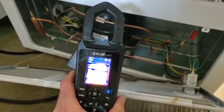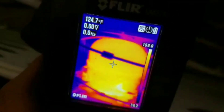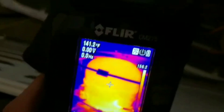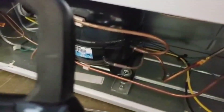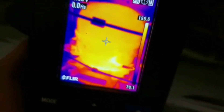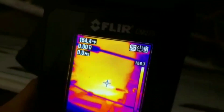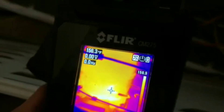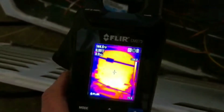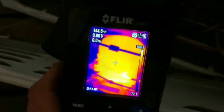I'm taking a thermal snapshot of the compressor here. You can see the crosshairs is reading about 140 degrees Fahrenheit. That purple line moving across is actually the suction line — we see the difference in temperature by the difference in color. If we look at the bottom right corner, you can see where the discharge line enters — it's actually glowing white. Pointing the crosshairs there, we instantly get a higher temperature reading. We can see the hot and cold spots of this compressor, which can help with troubleshooting and maintenance.